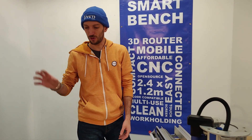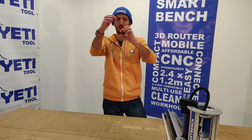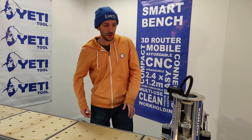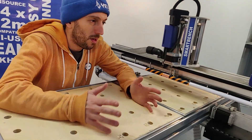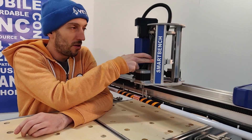If it were me, I would probably go to a 12mm ply for speed — just screw the thin gauge sheet onto that 12mm ply, so it can absorb the thickness of, say, a 10mm or 8mm screw. I've split the beam and you can see underneath there's now a gap — this gap can be up to 150 millimeters, meaning you can cut anything up to 150mm thick. Over here in the carriage we've got the Z-axis, which can move the spindle down 150 millimeters as well, so it can cut your 150mm stock.